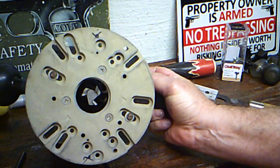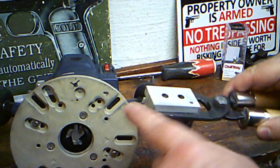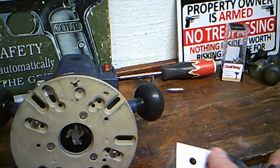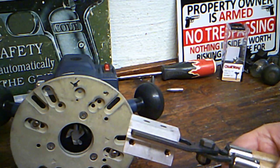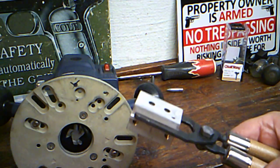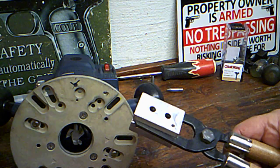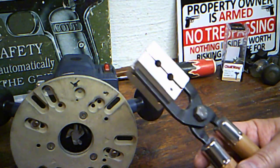I was taking off 20 thousandths passes on the top of this. Of course it's all aluminum, but it went through that with a 20 thousandths pass — it was like butter. I mean, it was just up one side and back down the other side and reset for a deeper cut. It came out really nice.